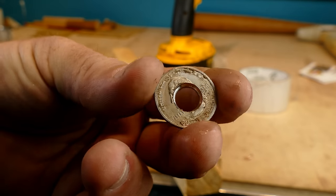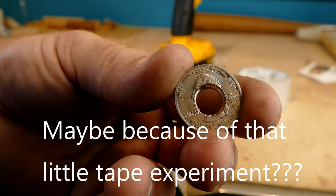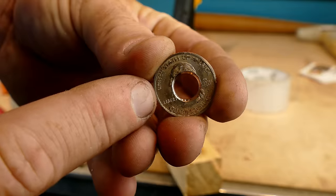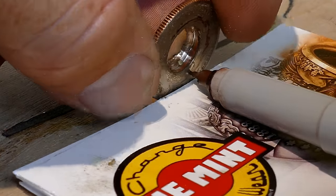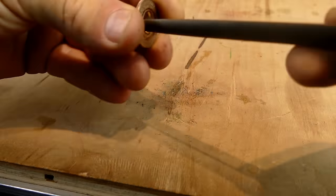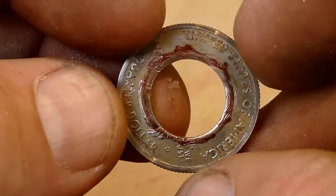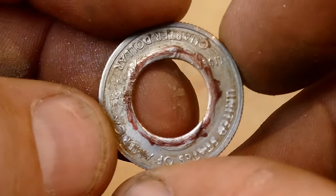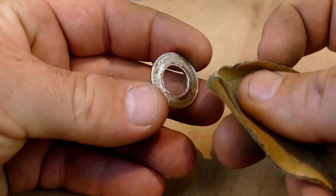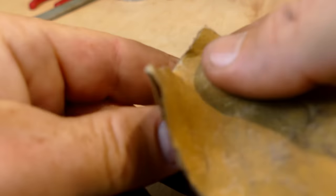This is a good example of seeing a hole that's not perfectly centered. If the hole goes off center — maybe the drill bit slides or anything like that — you're just going to re-mark a hole in a similar way to how we marked the center, going around the outside, and then just file your way to where it's perfectly centered again. Now you can see the area we need to cut out, so we'll do that with a half-round file. One hour later — it looks pretty even all the way around now. Just take your time in this step; it's really important you get a nicely even ring. Then get some 120-grit sandpaper and make sure you sand the inside really good so it's nice and smooth with no rough edges inside at all.